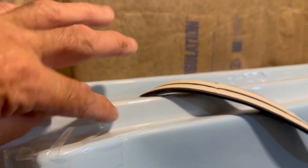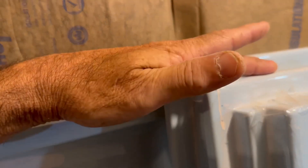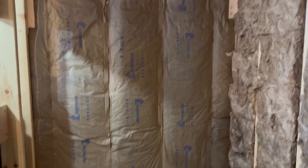We couldn't really do any time lapse because the space is so confining. So we're going to do this room next, and then maybe some of the hallway. And then we're going to put the tub surround in — which is right here. We've got to install that; it goes in before the drywall. The drywall goes over the top of this and over this lip here. The tub surround is next after the second bedroom.